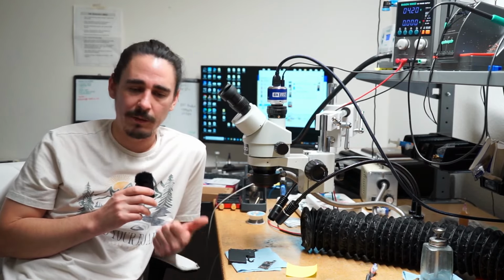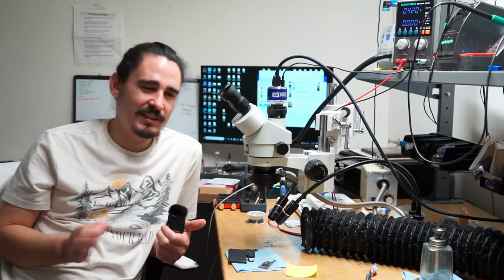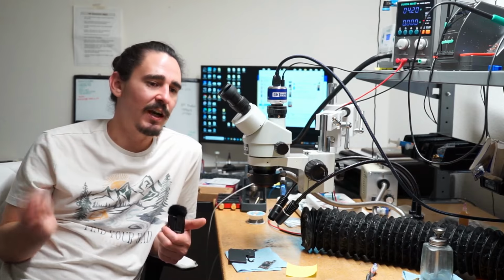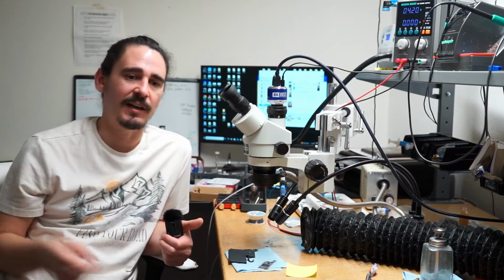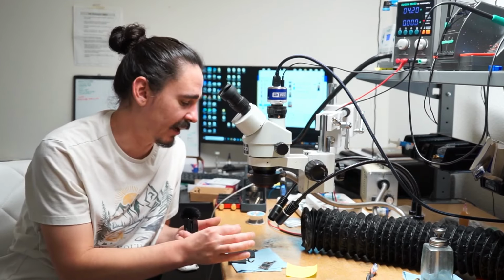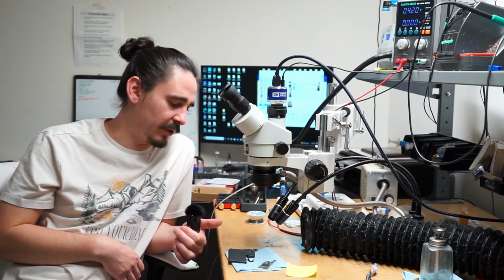If the boost coil is missing, or if I have a shorted power rail, I'll almost always see some small little blip. In the past, I've said that flat zero could indicate a boost coil or a shorted power rail. But in reality, it's almost always going to give me some tiny little spike. I used to have a cheaper power supply, and it wouldn't give me this third digit, and that's kind of where I got that idea from. Sometimes it was only a very small blip that would show up on that third digit, or very quickly. While I was looking down, I'd see the spike, and look up, I'd see nothing. But I almost never receive completely flat zero, and that's what I was seeing with this one, so it was completely different than what I normally see.